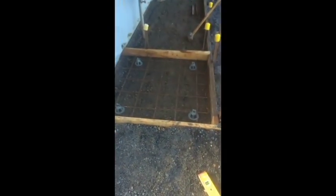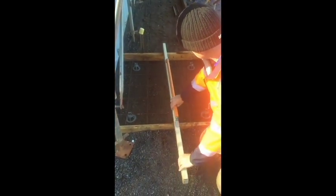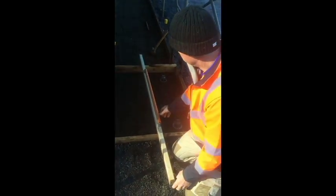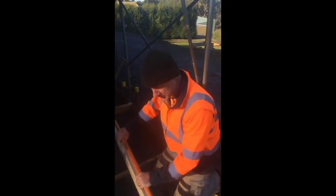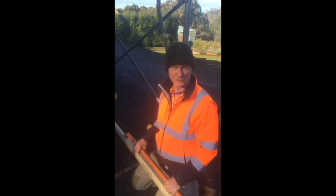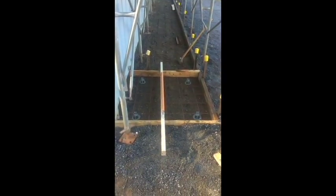Check the site where you're going to pour. We've got our screed ready to go. If you're fairly new to concreting, work the screed from boxing on one side to the other so you can go across the boxing to get the concrete straight — experienced concreters can do it without that. The screed has a round edge and a square edge; use the round edge facing towards you, and if it's not working properly just flip it around.